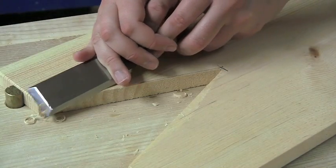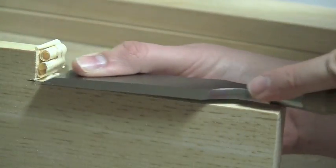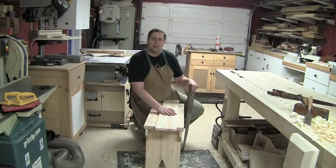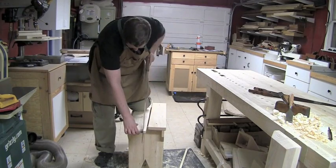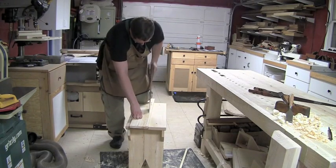The important thing here is just to make sure that you look for that feathered edge — it's the same thing I'm doing here with the chisel, just waiting for that edge to pop up. I realize you might be a little tired after all that ripping exercise and then building this bench, but you've got to try the thing out. Grab yourself another board, mark some lines, and practice a little bit more. You can actually pull it up here on top of the bench and use the ripping notch.